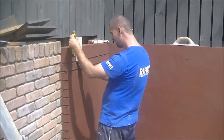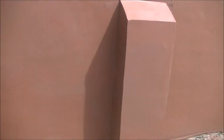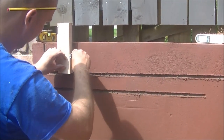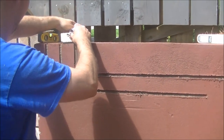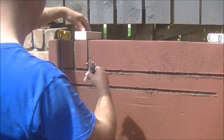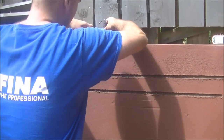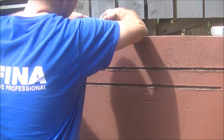The thing about wire is you can actually shape it pretty well. If you've got a round mortar joint to cut out, you can make a round piece of wire. If it's square like these are, you can make it more square, which to me is why wire is good. The only thing is, this type of wire I'm using does bend a lot, so sometimes you have to adjust it through the job. So on a real crisp job, you might be better with something like a small tool cutting, where it won't go out of shape as much.